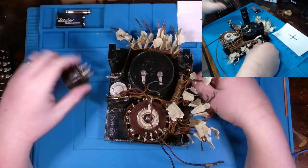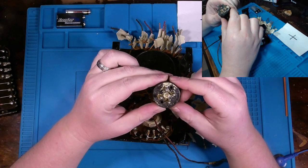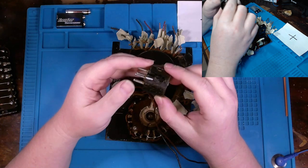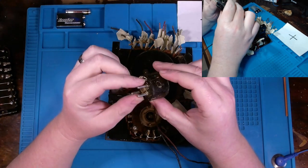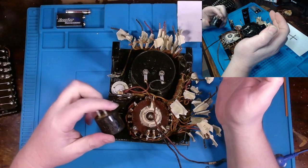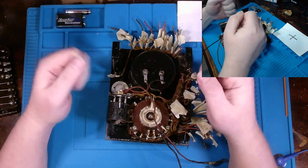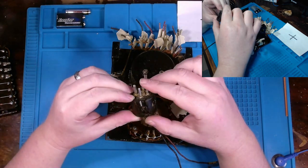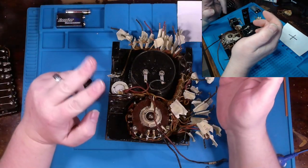I want to address the things on here, and also want to address our rectifier as well. I removed it from here, but we'll have to loosen up this nut that you see right here, and then I think I should be able to pull this out and remove what I think is the selenium rectifier. And then we're going to use two diodes to kind of rebuild our rectifier. I'll give good consideration to what diodes I'm going to use, but for the most part, it's just going to be an experimentation. I don't know for certain what diodes would be the very best to replace this with, but based upon the voltage rating of several things under test, if you were to use this multimeter, I would at least want to use a diode that is rated for at least 600 volts, if not more. Or several diodes, two to be exact.